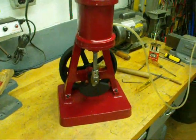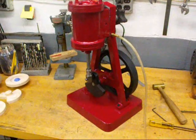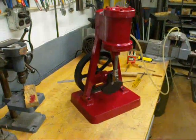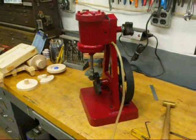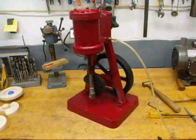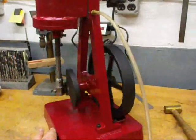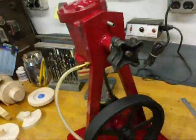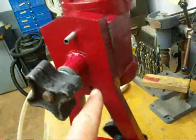Got it all back together and we're going to run it. We've got about a two and a half inch bore and an eight and a half inch flywheel. Don't ask me how many horsepower this is — I don't know, and it doesn't matter. This is strictly for the fun of it; there's absolutely no use for this engine now that it's complete. It was just fun making it. I'm running this on about ten pounds of compressed air, and I suppose it's around about 50 to 60 RPM, and it runs pretty nice. Might be a few little adjustments I still have to make. We've got exhaust coming out of this little pipe, and I think I'll put another little pipe down there just for the heck of it.